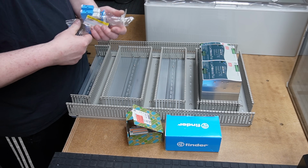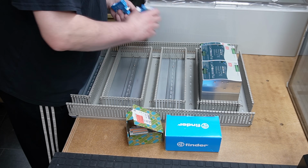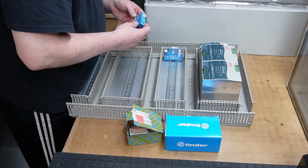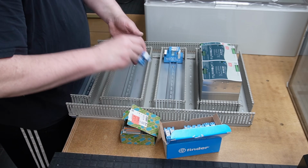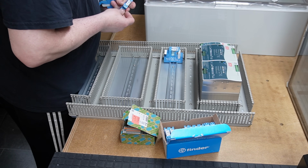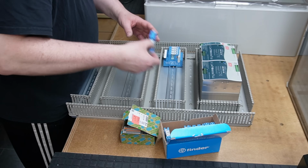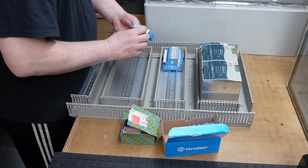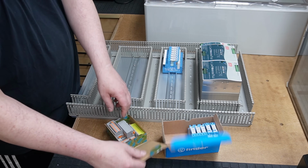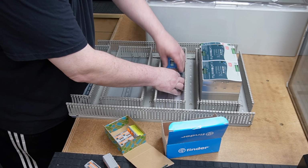After the PSUs, I added the relays and the 24 and 48 volt distribution blocks. The relays on the far left are used to switch the magnetic coils of the air valves for the ATC spindle, the tool setter cleaning and the air cooling. Since this router is used exclusively for milling wood, I'm not adding any MQL cooling. Other relays are for the integrated Z-axis servo brake, the touch probe activation, and as a contingency for later functions I don't know about yet.